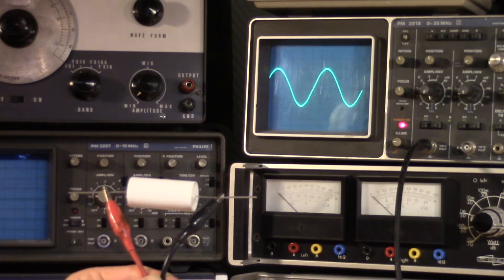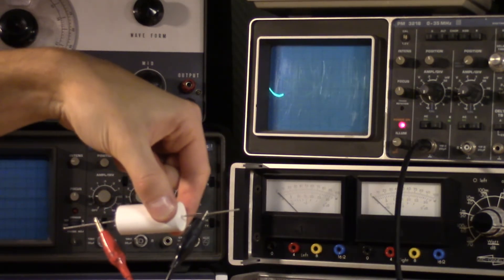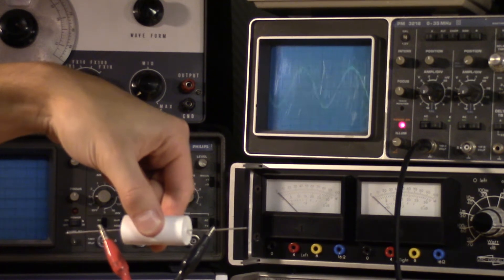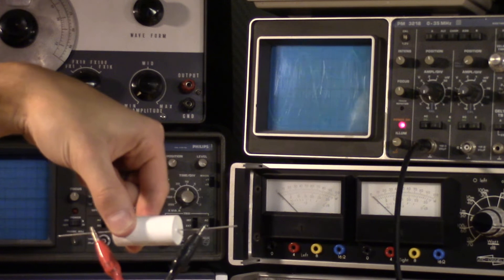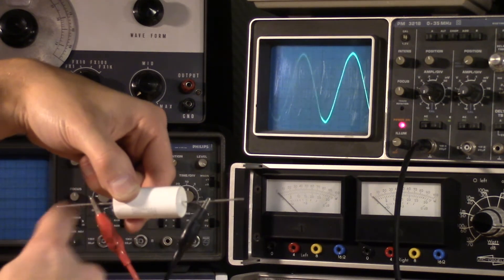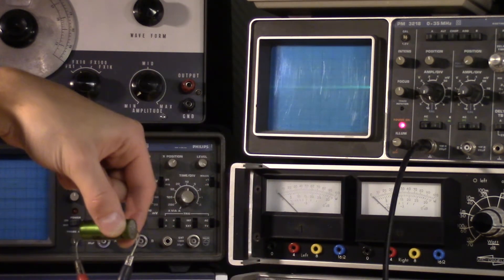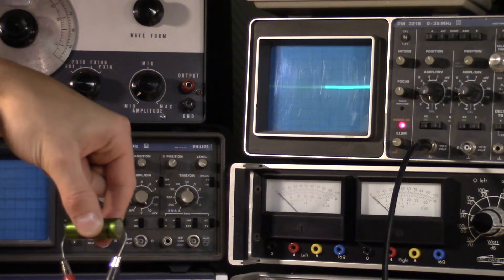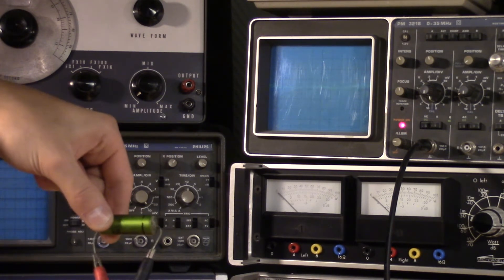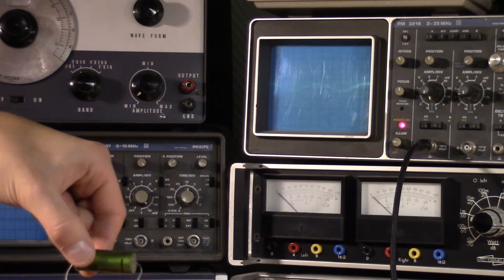Let's test that out. Here we have the capacitor hooked up to the oscilloscope again. I'm going to move my grip from right to left and we will see how much the noise changes. About 4 millivolts... about 8 millivolts peak to peak... about 14 millivolts peak to peak. Now I guess most film capacitors will have this behavior — as you move closer to the high impedance terminal, you might be coupling directly to that node. Let's compare it with the older capacitor, hooked up in the correct way. Here we see basically no noise whatsoever — not in the middle of the capacitor either. Barely anything closest to the terminal. Now right on the edge and we can see there is some noise.